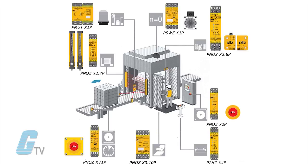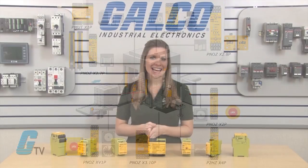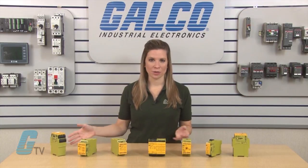They are available for use in different customized safety function applications, such as e-stops, safety grids, and light curtain units. Other units can offer safety functions for two-hand buttons, pressure-sensitive mats, standstill monitoring, time monitoring, and muting. Contact expansion modules are also available.